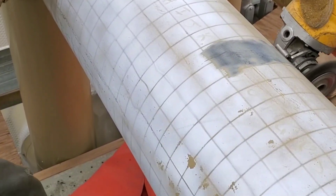The helpers have to buff off the paint so that way we can obtain full penetration and not be welding through paint, which will basically catch porosity.